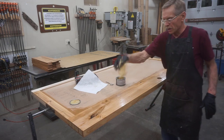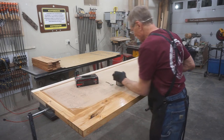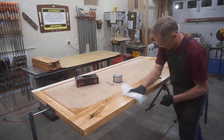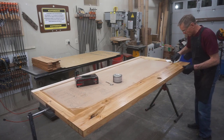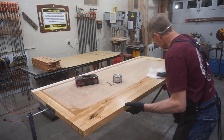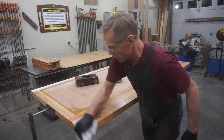After a good 10 minutes of wiping, soaking, and reapplying, the gel poly starts to stiffen up a little bit, so I switch from a saturated paper towel — being careful to open it up and let it fold out, because I don't want to leave it sitting wadded up as it can and will catch on fire. I switch to a clean dry paper towel and do an initial wipe down of all the areas. You can quickly feel when doing this just how buttery smooth that surface is.